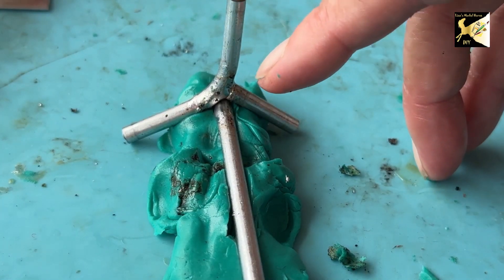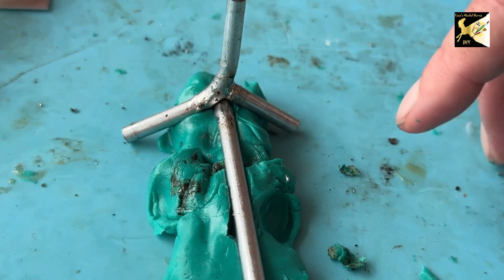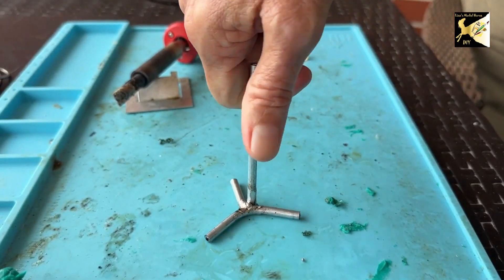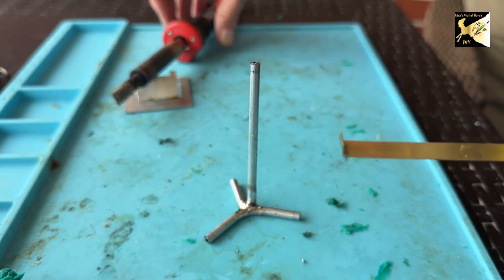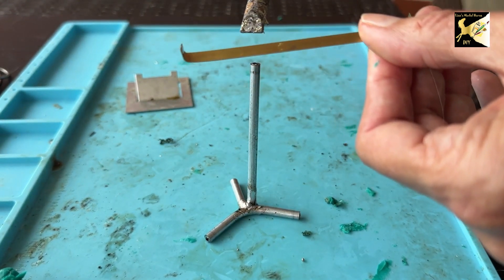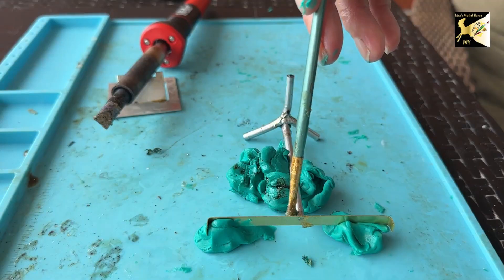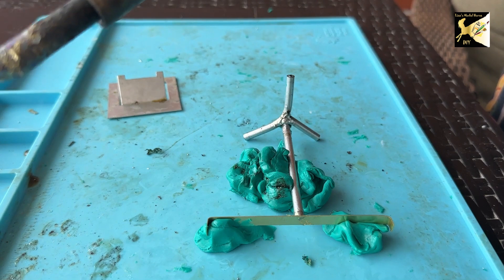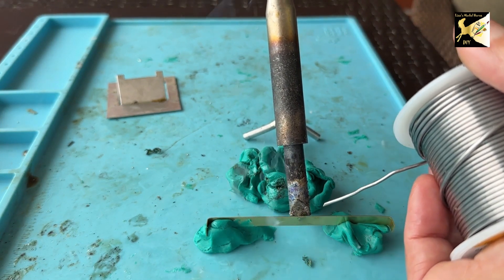One of the things you need to do is get creative. You can use the Play-Doh for all sorts of support — this will give you even better results than trying to hold it up with pliers. Now when you're adding a different metal such as brass, brass solders much quicker. So when heating up the metals, you want to put the heat onto the steel more than the brass, because you need to heat the steel up more. Apply your flux to both sides, put the heat on the steel right inside the join, get your solder ready, heat it up, then just drop a little solder in. And you're done.